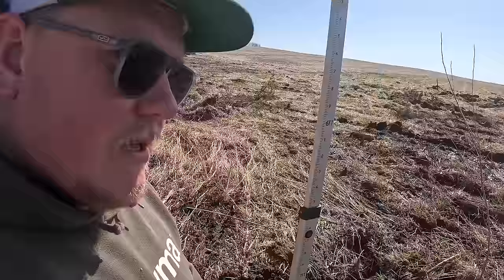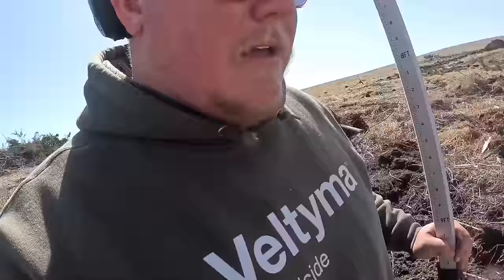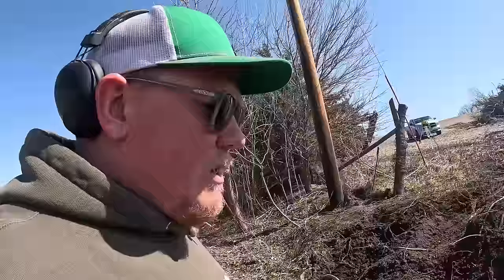Now we should go down with the staff. Good, we're gonna have quite a bit of fall. Up a little, 8'2½". What did I say the first one was? Dang it, forgot already. 9'2½". Sorry, I was right. So did I say 8'2½" the first time? Anyways, 9'2½" is what we have. So basically I got a foot of fall that I get to work with as I dip this ditch out. That's really not gonna be difficult.